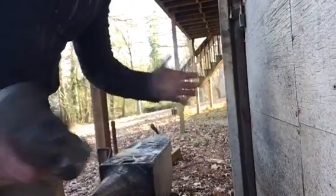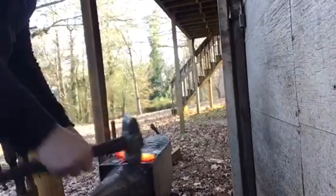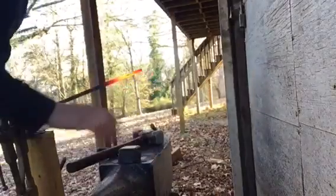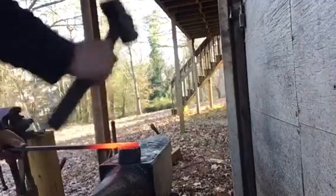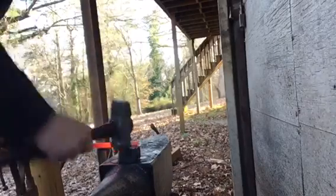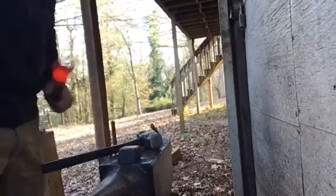Let's say I'm out here working on a knife — everything's going well, but as you can see, about here I can't draw my bevel down much thinner because the toe of my hammer is hitting my anvil. So I can take this guy, drop it in my hardy hole, drop it up on the edge, and I can really isolate the areas I want to work and draw that bevel down nice and thin. So there we go — that's the stump anvil build start to finish. It's going to be really useful in a lot of upcoming builds, so stay tuned to the channel. If you haven't liked and subscribed, please do so, and thanks for watching — everybody take care.